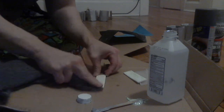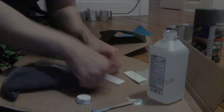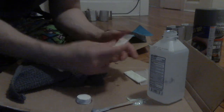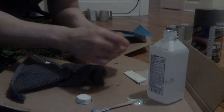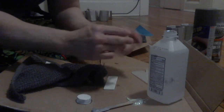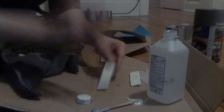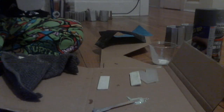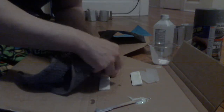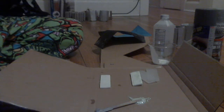And voila. And done. So it's smooth, but not smooth like the back would be. Not smooth like this. This is really nice and smooth. Not like that, but it's very smooth. And so anyway, now when you're done with that, again, you want to go with your tack cloth, just go over it like that. Very, very gentle. And now you're ready to paint it.